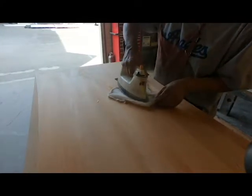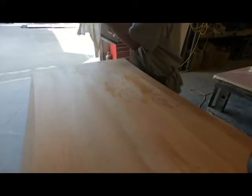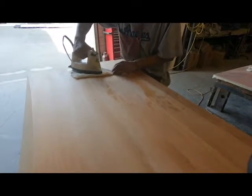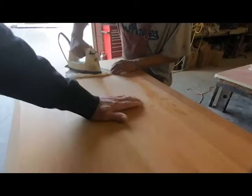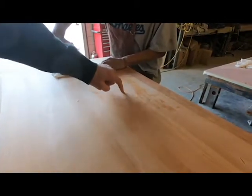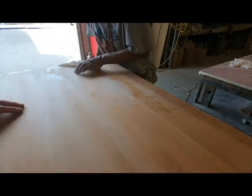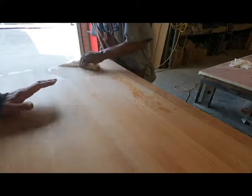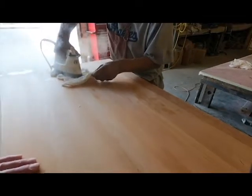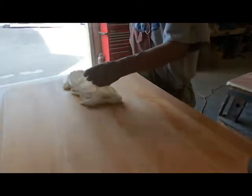So it's coming. These were deep, deep, deep scratches. We were getting a good result. See, I can't even really feel it. I can see the scratch where it was before, but I can't feel it. So those wood fibers are swelling up really well with this solid lumber. This even works with veneers. We've repaired some very deep scratches in veneers as well, with the same technique.